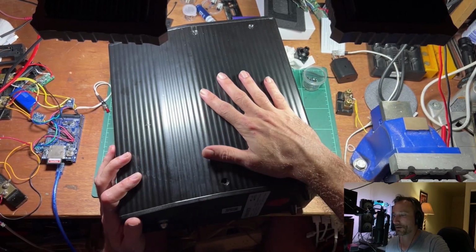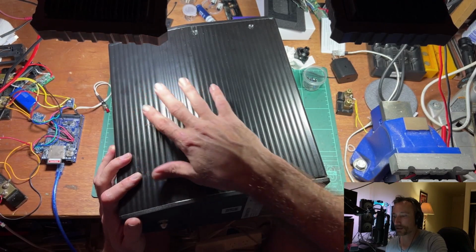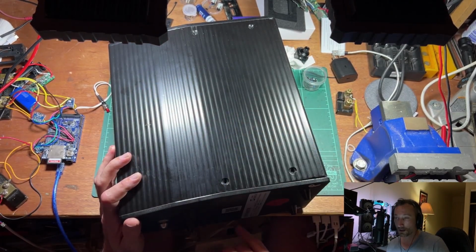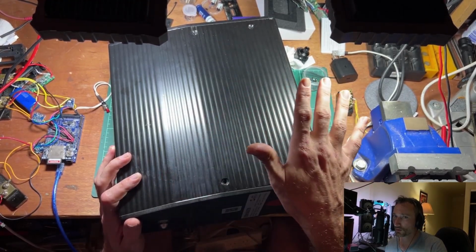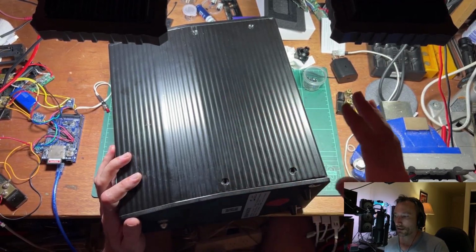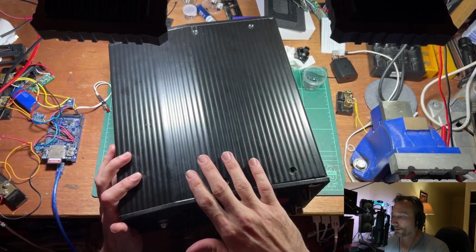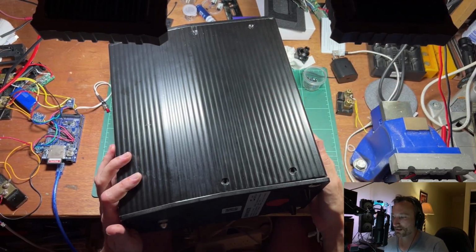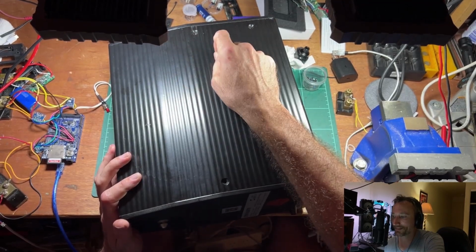So it's either self-discharge or the battery management board inside has discharged the pack down to 58 volts. It's a nominal 72. So at 58, we're looking at about 2.9 volts per cell. So not too low. I think just below what the charger wants to see before it'll charge. Well, what that means is that this pack is not usable. So we've got a new bike with obviously a new battery in it, and we can't charge it. It won't run the bike, obviously, because it's flat, and we're stuffed. We've got a new one on the way to replace it.